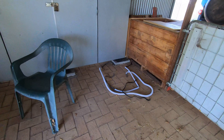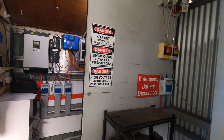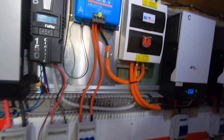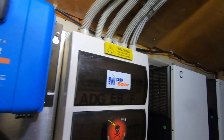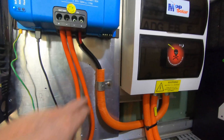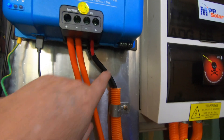Ziggy and I the last few days have been doing some work in the power room, and there are all the wires we took out — they're all six millimeter squared. I know some of you think those wires are too small, but they're actually not. Wire sizes look different, but what we did was we combined a few strings in the combiner box up there and upgraded the wires from six millimeter squared to 16 millimeter squared. We shifted the Victron up higher and put it — because we combined another string into it, which was G string.